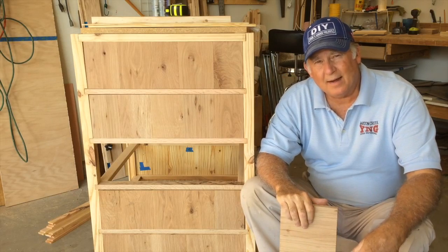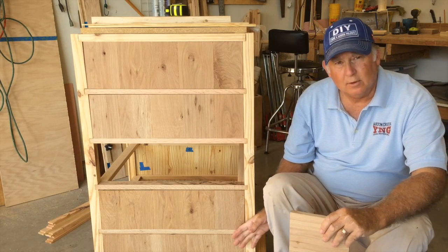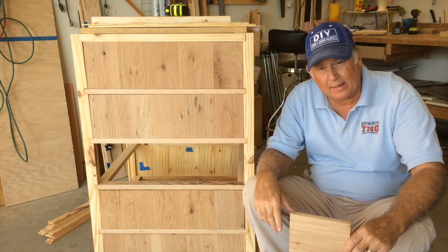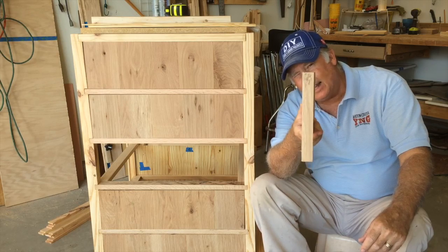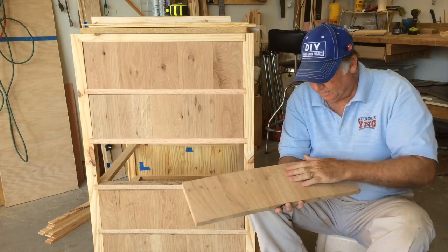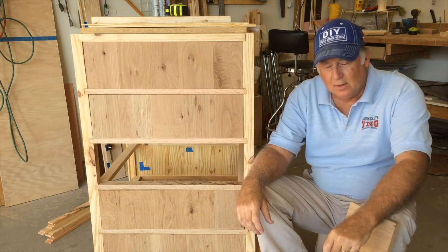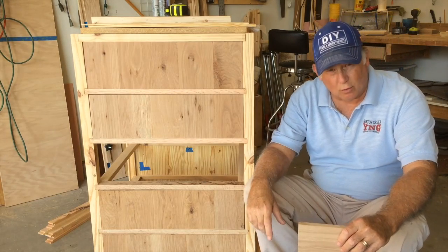So here we are — I have my dresser and my drawer panels completed. Front and back: these are oak on the front and pine on the back. However, I have one drawer panel with a little bit of bow — actually a lot of bow. I'm going to have to remake this one. I have a feeling I was clamping it with too much pressure and the weight of my clamps caused this. So we'll make one more of those and then we'll be ready to start on the drawer boxes.